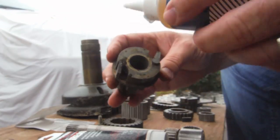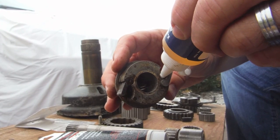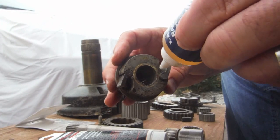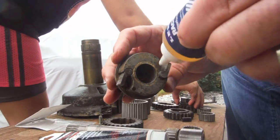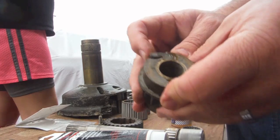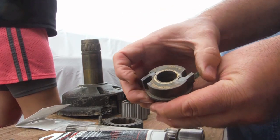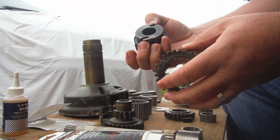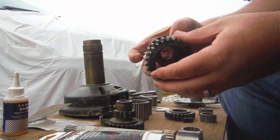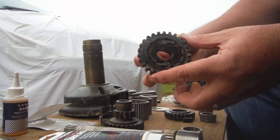We'll get a little bit of winch oil — it's just a lightweight or graphite oil. I'm only putting two drops in there, then pushing this in and working it back and forth a little bit. You can see even where this one was sticking before, these are much better now. The easiest way to do this is to just pinch these down, then rotate in the direction they would fold down while inserting into the gear, and they'll go right in.